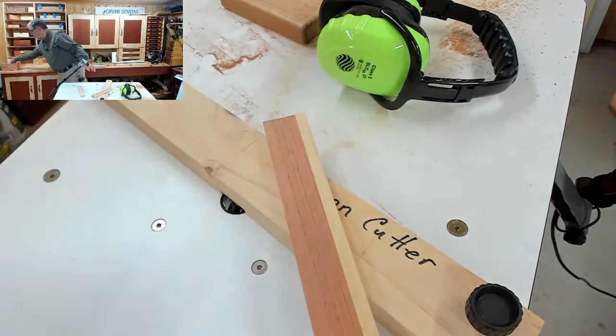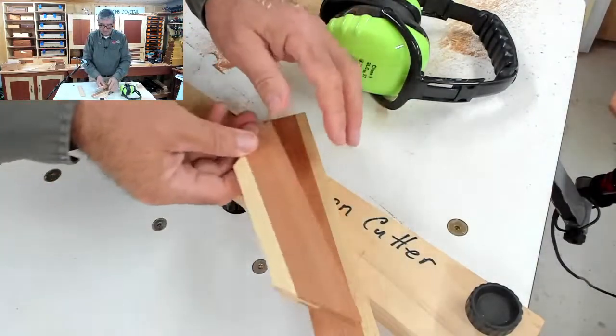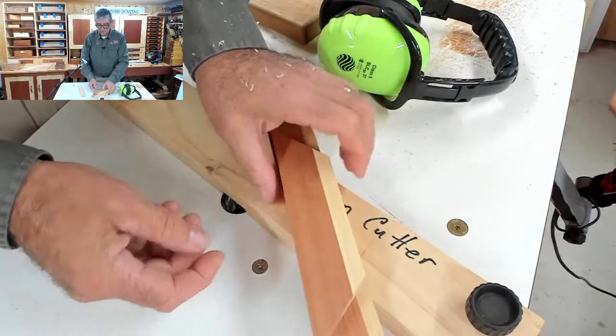I only took a very small amount off and as you can see that now fits — it goes in nice and neat and very snug, quite a nice joint. What I would do now is glue that together, put some clamps on that, and then cut the excess off. It's quite snug — it's not going to go anywhere. So over to the drop saw — I'd have a mark on here for how wide I want it — I'll do this at 10 millimetres. And as you can see, I now have a panel. All I need to do is cut my diagonals on that, and I also have that little gap to allow for expansion. Glue that together and that becomes my wider board.